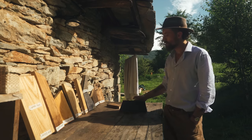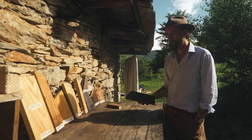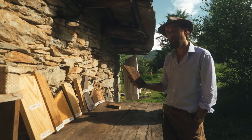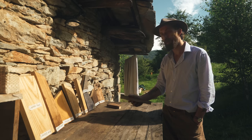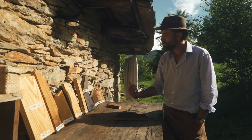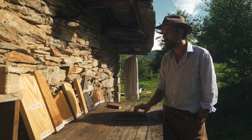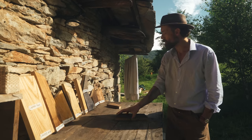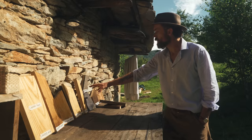So I could imagine if you build a door with a traditional design for the cabins and you do it like this, it would look quite convincing. This is not good for the deck because it's way too dark and it would get hot from the sun, and also it still gives off some black, so it needs another finish, and it could be linseed oil. So this is charred, vinegar and steel.